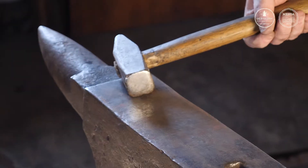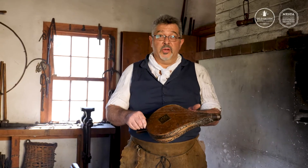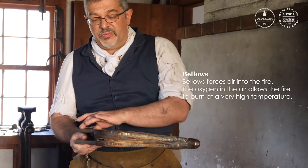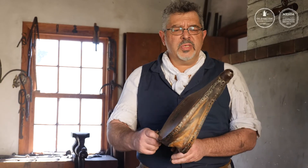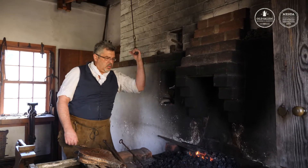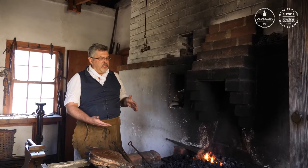Today we're in the process of hot forging. That involves the use of a fire, a hammer and anvil to apply pressure. But the most important of these tools is our bellows. Our bellows is up in our gable area of the shop — it's six foot tall, taller than I am, and four feet wide. When it's fully filled, it comes up to my waist; it's four foot tall. Our bellows upstairs will give you 20 to 30 seconds worth of air. This bellow gives you about one second. So we're filling our bellows right now — and that's full at this point. This is one continual blow of air.